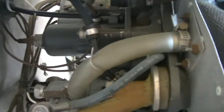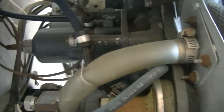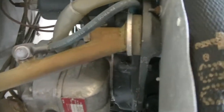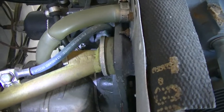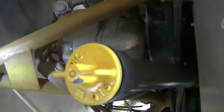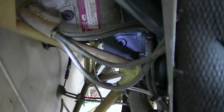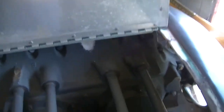So anyway, make a thorough examination of your engine compartment. It's also a good opportunity to look for any cracks or anything that may be going wrong on the motor mount. It's also a good opportunity to look over your intake tubes and your exhaust manifold and exhaust pipes.